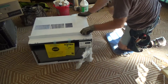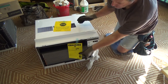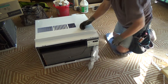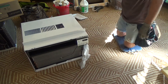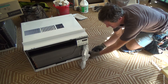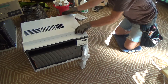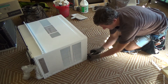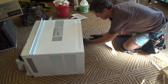I always carry my little knee pad. On this particular unit, I'm going to go ahead and remove the energy guide label — if I were doing this for a client, I'd save that along with the owner's manual to give to them. Now, for this housing, I need to pull the insert out, but before I do that there are some shipping screws that have to be removed. On yours they might be in a different location — just take a look. You could be sitting there for 20 minutes figuring out why it won't come out; you just have to get the screws out first.